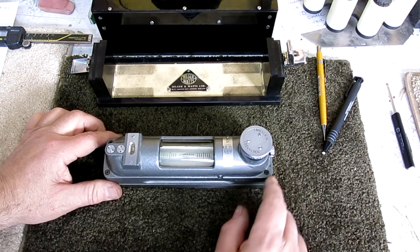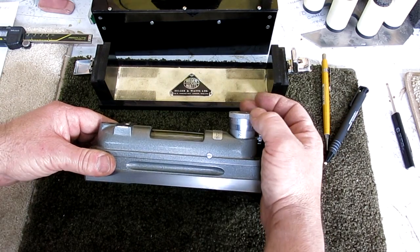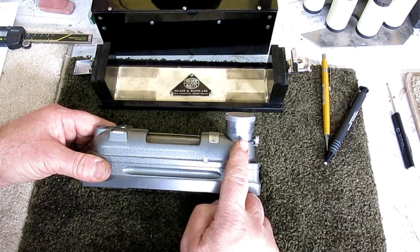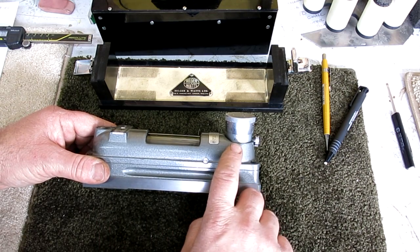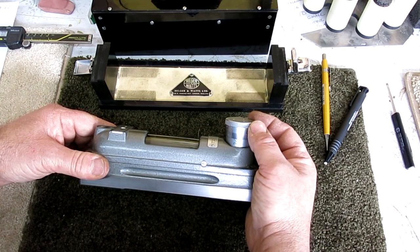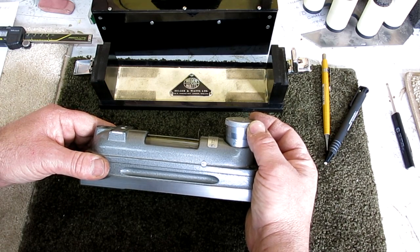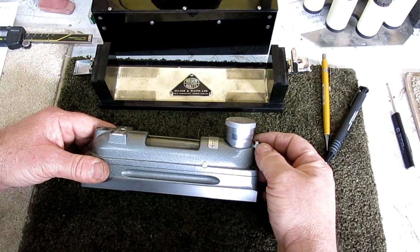That's what they got, a tenth of a millimeter per meter. What makes this thing special is that it has a micrometer adjustment here on the side. So we can actually measure slopes with it, small slopes, up to roughly 2 degrees. Each one of these divisions is 1 minute of angle, and a full turn is 1 degree of angle here, and it has a little lock knob.